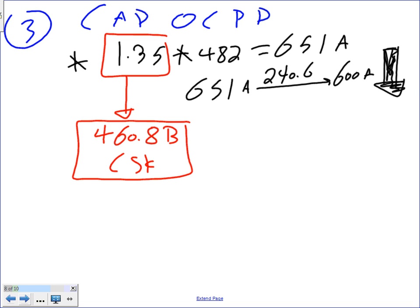That's why I put CSK as my initials right next to it. So what I usually do, I size the overcurrent device to match the conductor, because I'm protecting my conductor. So this is how we size the conductor, 1.35 multiplied by this. But instead of going up, because they say as low as possible, I went down. So please put the CSK here. It's an opinion. There is some opinion in it because the code doesn't say exactly what you want it to do. Any question? So we size the conductor based on 1.35 and the overcurrent protection device based on 1.35.